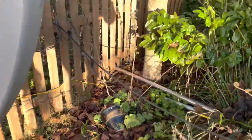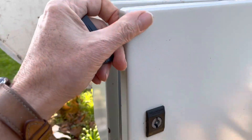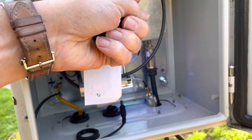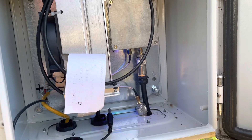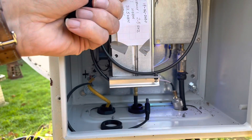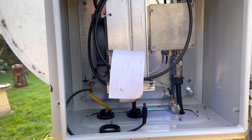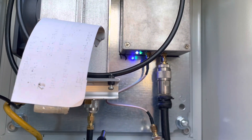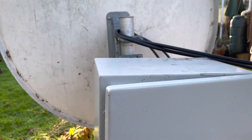Around the business end, because of the frequencies involved, all the amplification at 2.4 GHz needs to be kept locally. In this box I've got the up-converter which is currently up-converting 2 metres, 144 MHz, and that's coming into this amplifier here which is amplifying it up to about 3 watts. You can also see the reference signal coming in, and I've got a green and blue LED on there — it means there's power to it and the LO is locked.